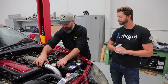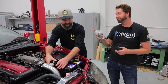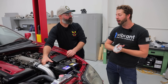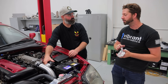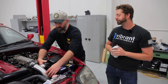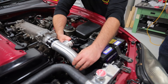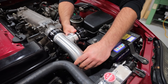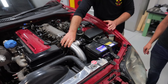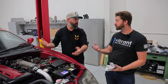All right, Greg fit that up very easily — easier than Pete and I seem to be able to do it. It's almost like you've practiced with these before. It's the ferrules — because I used the alignment tool. It is the ferrules. It's all in the fit-up. All of the problems we see with the HD clamp all stem back to poor fit-up. And look at the amount of movement this allows — that noise you're hearing is just the ferrule at the bottom bottoming out. It's not hitting anything on the chassis, but it allows so much movement, which is great because as the engine rocks, it can articulate without stressing any components — especially with soft motor mounts, which we have in this car.